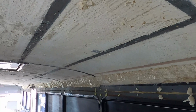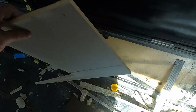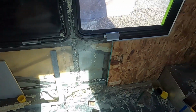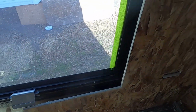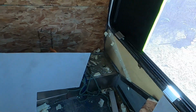At least I've done the ceiling, I've done the framework on the whole lid. The walls will have this half inch foam board here, which is R5. This will be over the top of everything, and then the OSB over that. I haven't decided on a finished material yet, what kind of wood I'm gonna use inside, things like that. So this is a little bit rough. I can always take my oscillating tool and trim this down a little bit so that I can put in a windowsill, and all this can still change, even with it installed.